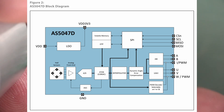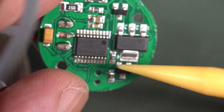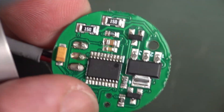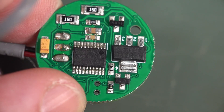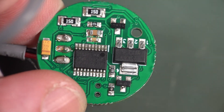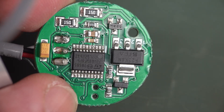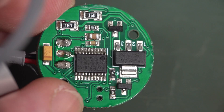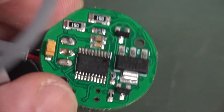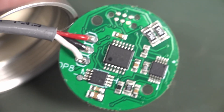All the magic happens in the ams Hall Effect sensor — it's got four sensors in there, lots of ADCs and lots of other magic. It can sample up to 10,000 times a second, and the microcontroller is just doing all that processing in real-time and converting it to the 4 to 20 milliamp standard. That is very interesting. Thank you very much, Sinusoid, for sending this in — I'll link it in down below. An Aussie-made company selling really high quality rotary encoders. Great stuff.